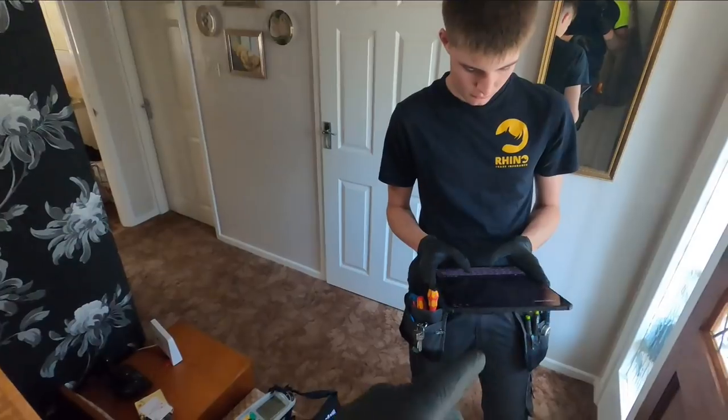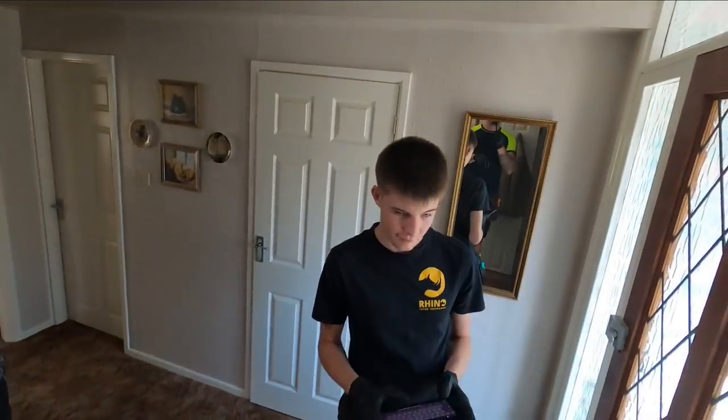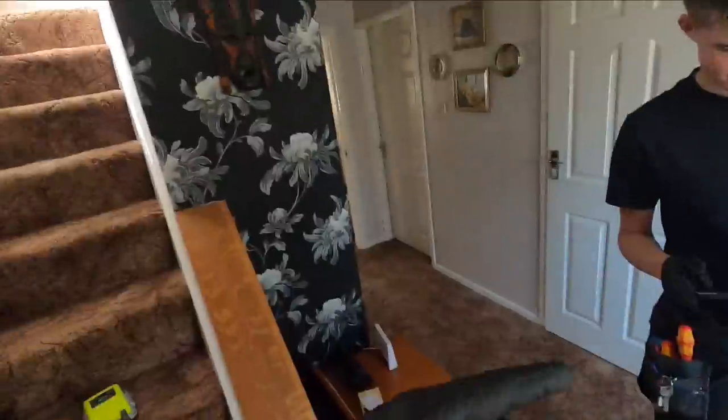This video is going to be a how-to on how to price a rewire. I'm going to talk to Adam like I'm talking to you, explaining the different steps I go through to evaluate and assess. Writing stuff down - Adam's got the iPad out. What I normally do is go across each room: hall, stairs, lounge, bedrooms - how many sockets, how many lights, how many ways for the switches.